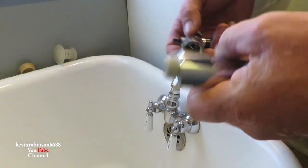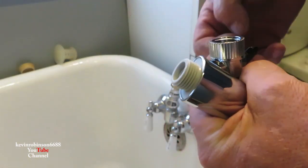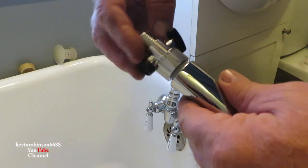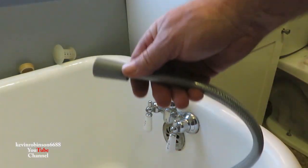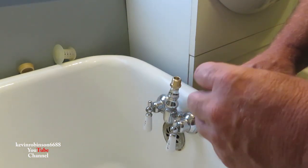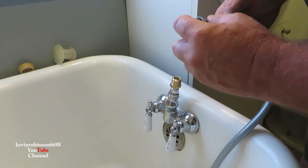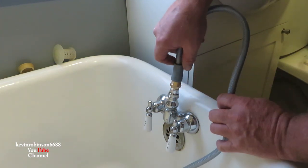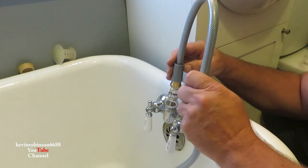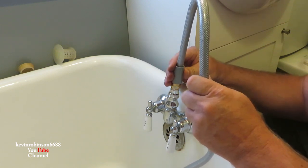It just takes a little O-ring — this one has one in it, so we're good. We're just gonna go ahead and screw this thing right on the end. Now we take our hose, put our O-ring inside of it, and screw it down on this guy. I don't think we'll need Teflon tape. If we see it leaking a little bit we'll throw some tape on it, but right now we'll just screw it down — it's sort of like a water hose hookup.